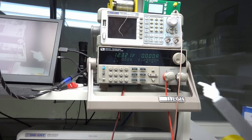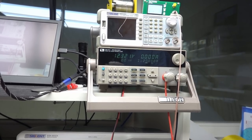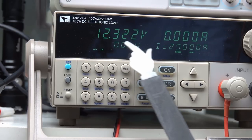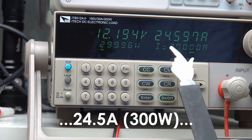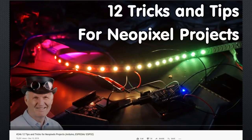I connect it to my 300W electronic load, so I cannot test the full power with it. But in HP we trust — I am pretty sure it will meet its specs. And if we check the stability, it is quite good: 12.32V at idle and only 0.1V less at 27A. For sure, sufficient for a large LED installation. I suggest consulting video number 246 if you intend to build an extensive NeoPixel project — dealing with such high currents needs some precautions if you want to become happy.